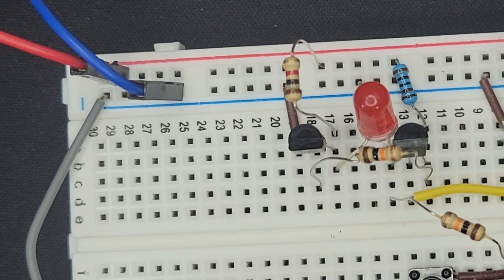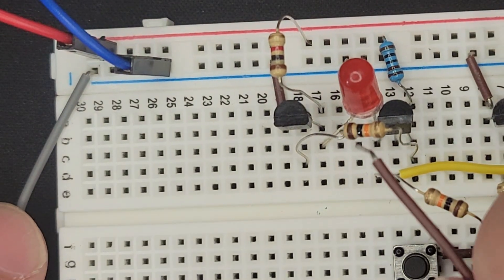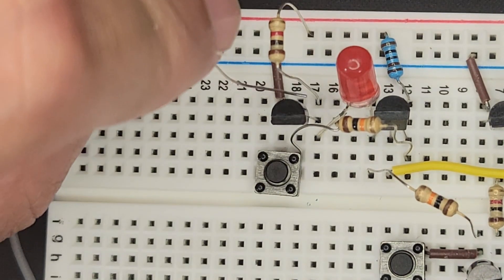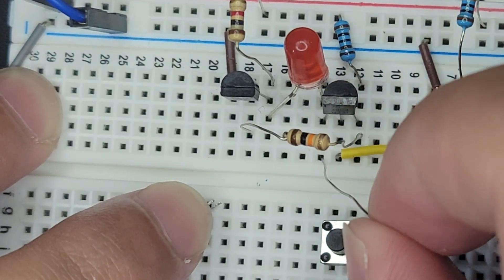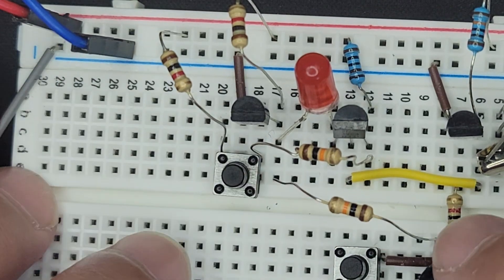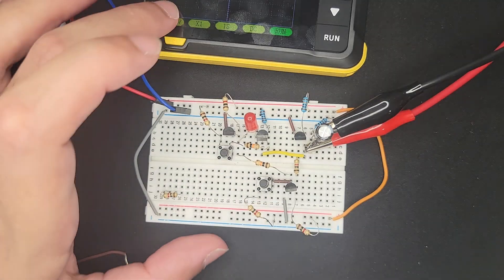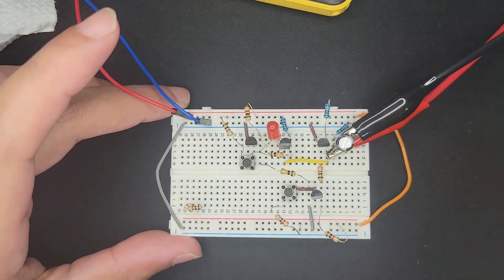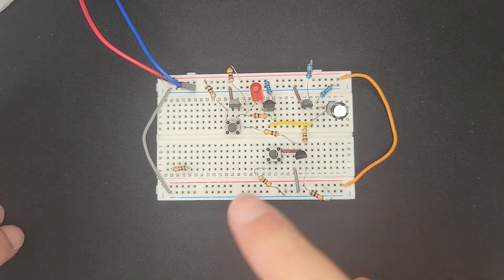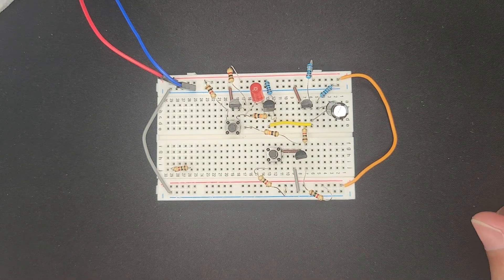Actually, I think there's a really easy way to do this — all we need to do is activate this transistor with a button. A manual activation to stop current from going out of these resistors. Let's add a button in line with that base, power it up with a 1K. I'm holding it down — let's see if it charges. And as soon as we tap it, it should turn off — and it does. So we have an on switch and a reset switch. The reset switch I wasn't planning to do, but it turned out to be very simple — all we do is force this transistor to turn on, which turns off the LED. It's very useful in a lot of scenarios. Mine is probably very bad compared to the conventional approach, but it's cool to have a hardware button with some intelligence that counts time before turning on.